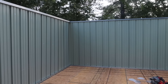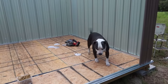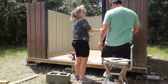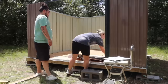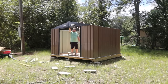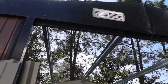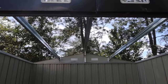That was day two. On day three we did the roof and the doors and completed the whole thing. There was just a little bit of trim to put on and then we got started on the roof. Make sure you pay attention when putting on the metal sheets for the roof because there's a certain order they have to go in. You'll have three beams that go up, and then from there it's a lot like the walls — a lot of screws but an easy process.